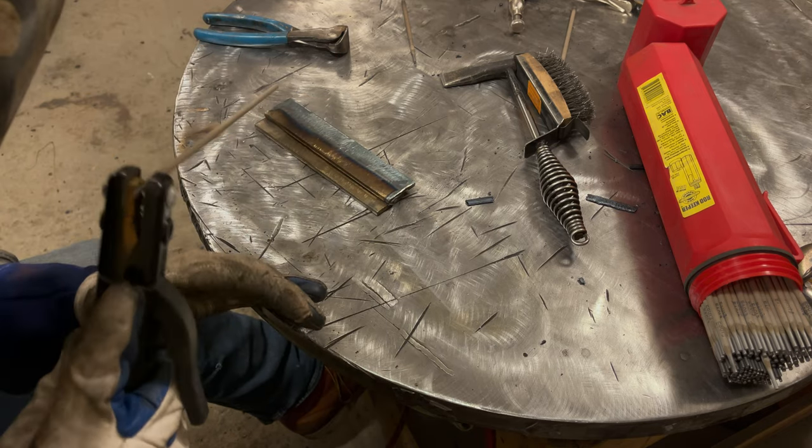You probably notice that welding in the upright position, which is essentially with this thick a plate just flat position, but you could argue and say it's horizontal, is not that much harder realistically to weld than flat with a thicker plate. So don't be afraid to try it. It's very important that real life doesn't have all just flat joints like this. You're going to have to weld stuff like this from time to time.